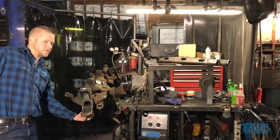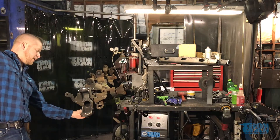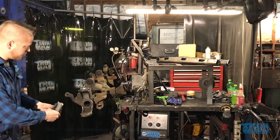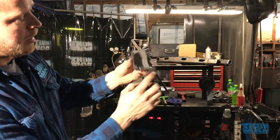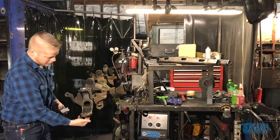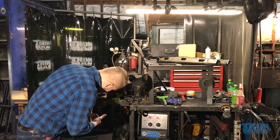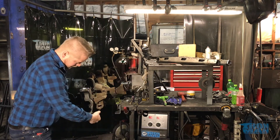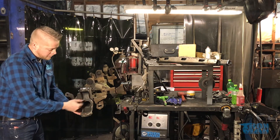The back side piece is very straightforward as well. This is the bottom piece — it goes behind where you can't see with the camera, but it's very straightforward. It's notched just to clear the bottom of this guy right here. I also ground some 45s in here and ground off where it's going to weld. This piece will rest right behind this in these little ribs down here. Put it up in place — if you have to grind it a little bit because all these sway bar things are a little different, go ahead. Make sure all your weld surfaces are as clean as possible, and tack everything in place.